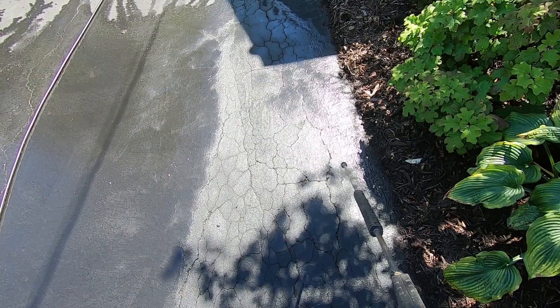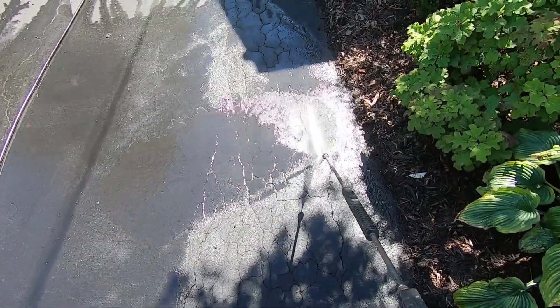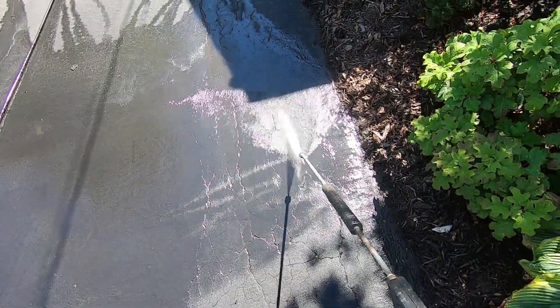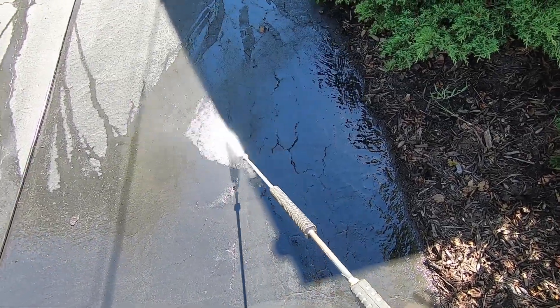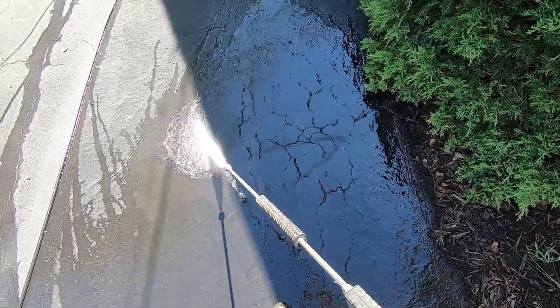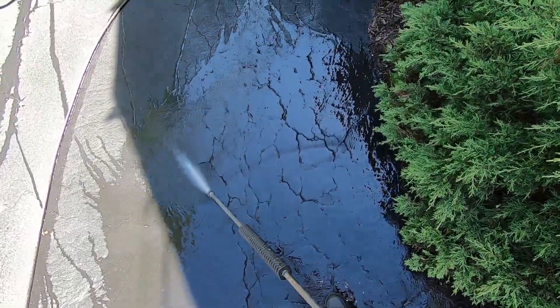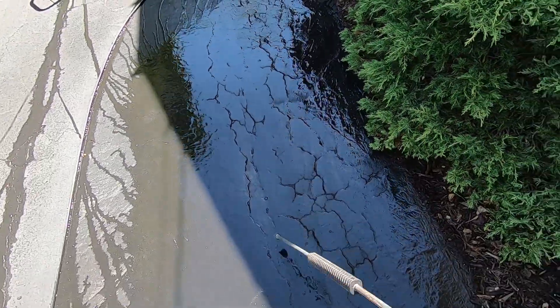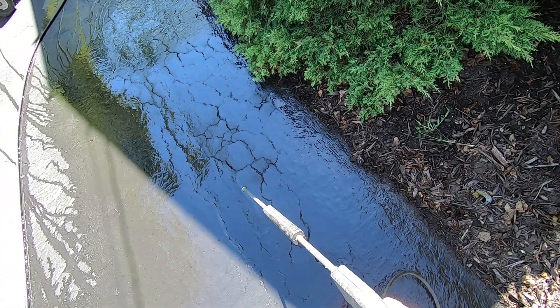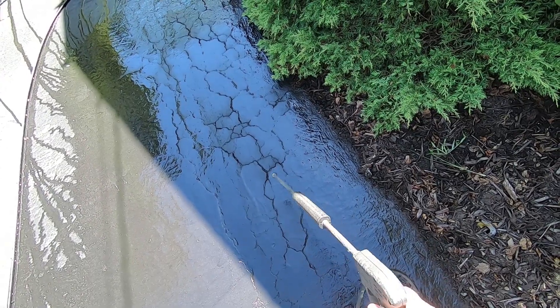The key is to clean out the cracks without knocking any more material loose. You notice that's a different technique than when you clean wood, because we don't stand any chance of leaving marks on the asphalt, whereas we do with wood.